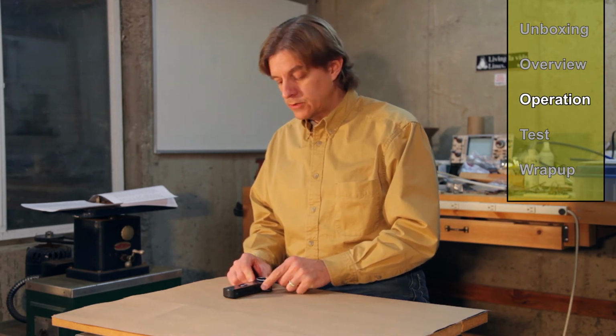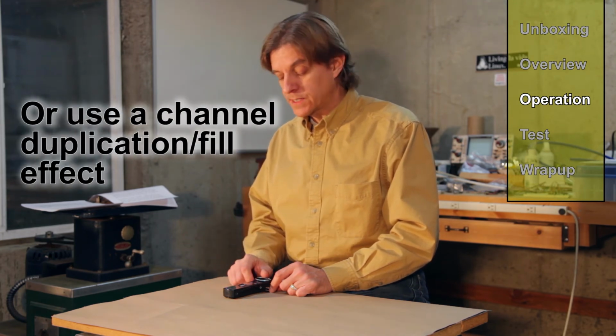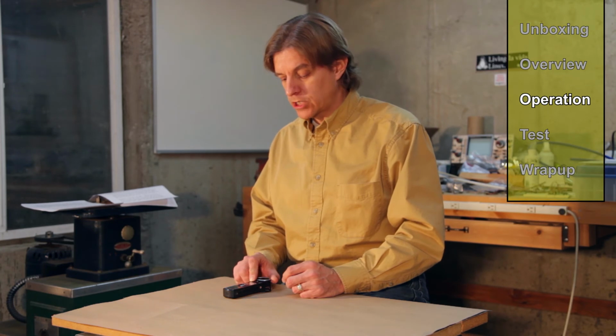The input jack is a stereo input, but if you plug a mono microphone into it, it will only record on the left channel. Of course, you can take care of that in post by duplicating the channel and putting it on both sides, but it is a limitation on here. You need an adapter for mono to stereo if you want it to record on both channels.